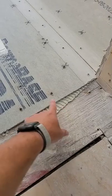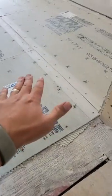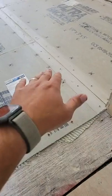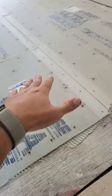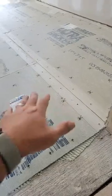You can see there's actually mortar underneath the cement board. What that does is it gives it an additional layer of support. With screws and bounce in the subfloor, over time it's gonna start moving a little bit, and you could potentially start seeing cracks in your tile floor in a year or two - maybe even longer, but at some point if you don't do these steps, you're definitely going to have cracking.